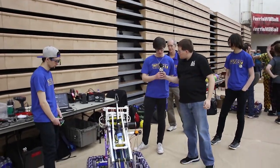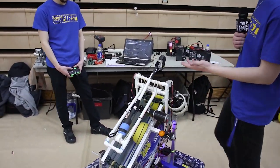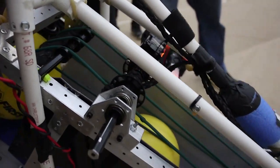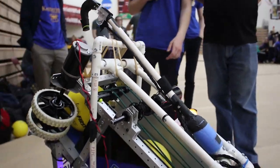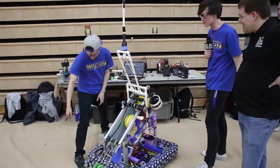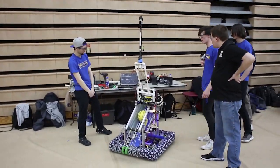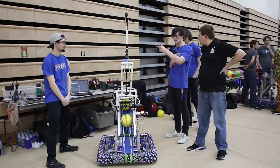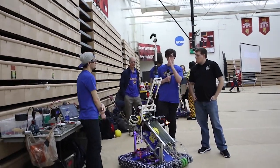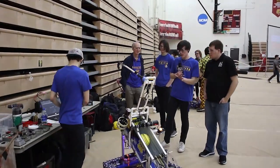Our climber works by — it basically has a winch, and the rest of it is only stored power with surgical tubing, so we were able to keep it really simple yet effective. Our winch starts running at the endgame start, and it actually breaks a small zip tie, enabling the arm to fling up. The hook will be attached to the arm, the arm will fling up, and then we drive forward into the rung and just winch down — the arm brings it down. There's no force going through the PVC arm, so we were fine using something with a little less structure and stability. It pulls down and lifts our robot up right at about the center of gravity, so we're able to balance our robot pretty well.